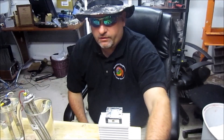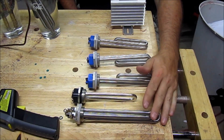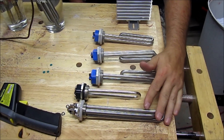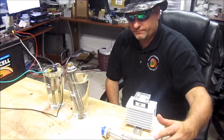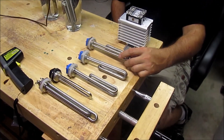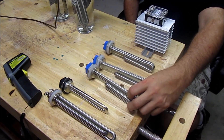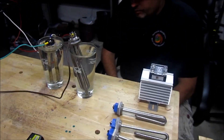We will be having soon a variable thermostat available for our elements, which if you use this for something other than diversion load, you're probably going to need that. Just a market note — I haven't seen a lot of 48 volt options out there. If you've got a serious renewable energy system that's off grid, our 48 volt 1kW element — a couple of those — will get you moving.